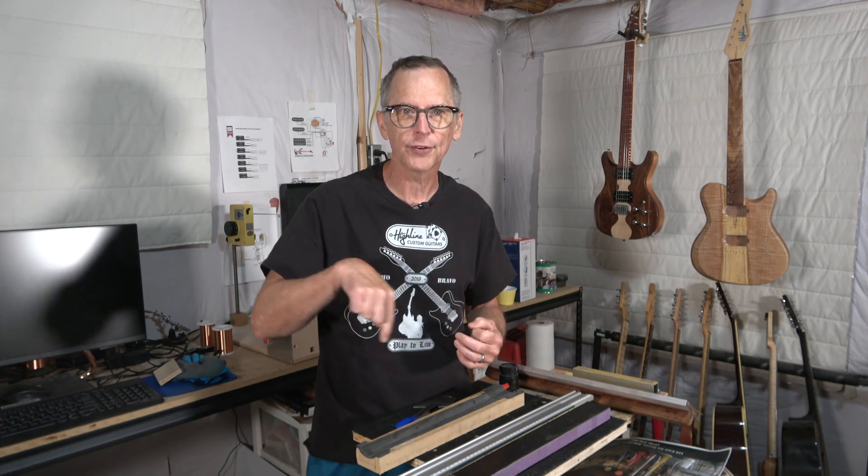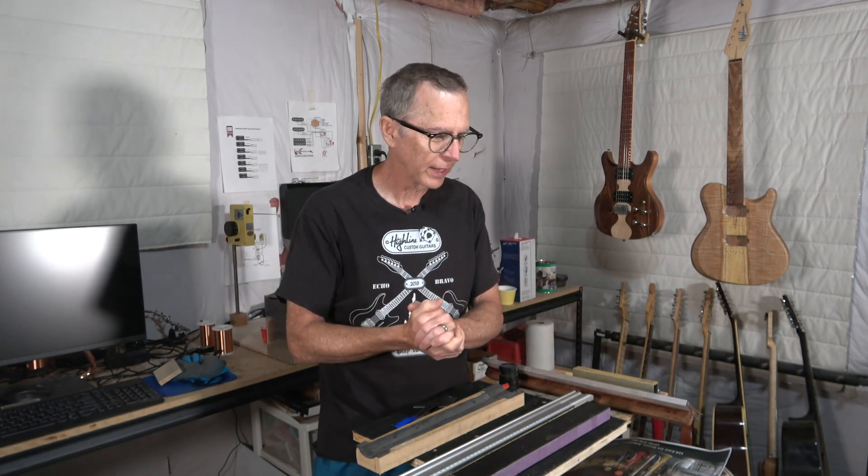There was one other cutting operation on the fretboard: cutting out the perimeter shape. There's not a lot to see there — I take a two-flute spiral upcut bit that's an eighth of an inch in diameter and cut out the perimeter shape, leaving tabs so that once the bit has cut all the way through the material the fretboard doesn't go flying around the shop. And with that, the entire fretboard is now finished. The next step is to make the neck, which I'll cover in the next episode, part 10 of the V-shaped guitar build series.